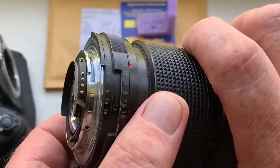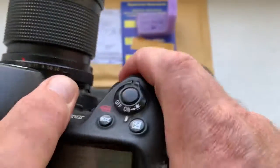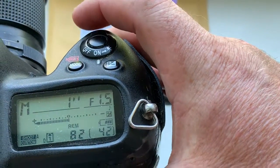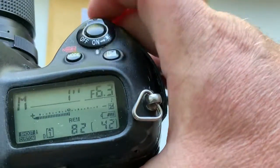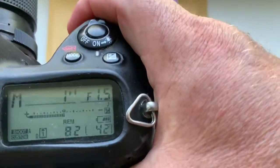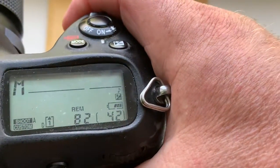Look, this is your new chip. Now I check it in my camera. I pre-programmed the focal length of 85mm, aperture range from 1.5 to 22, and the focus trap mode is off for your Nikon Z camera.